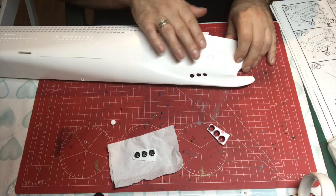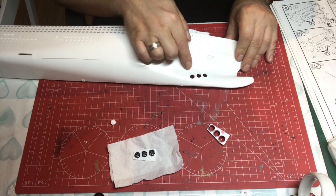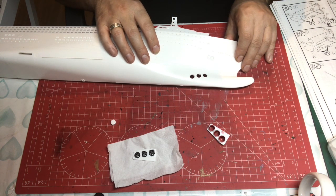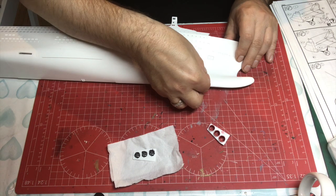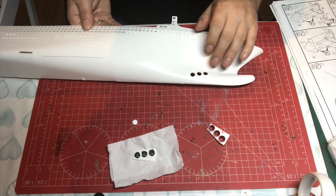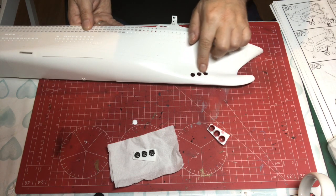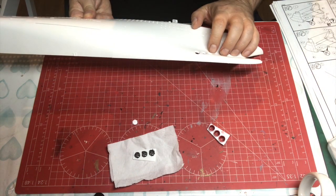So what I'm going to do is I'm going to try and have these open. So I'm going to mess around with the hull with one of these and make it work. And then when I've got that solution, I'll come back to you and show you what that solution is. My worst case scenario is I can't make it work and we end up gluing those permanently shut. But at the moment, you've got a soft mould edge that rolls into that tunnel anyway, so we want to sharpen that up. So doing the bottom's not a problem, and we may end up putting filler into this top, so we could put the chamfer in, and that might well be my preferred way of working here.